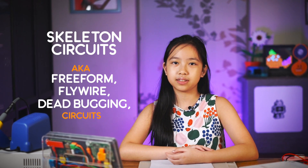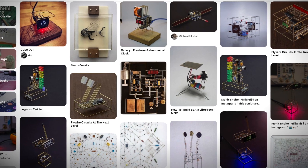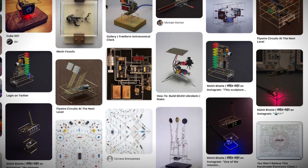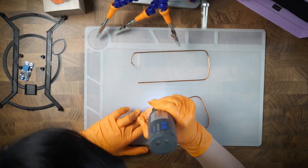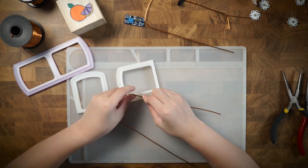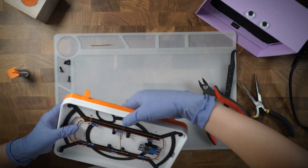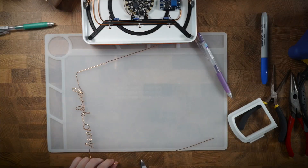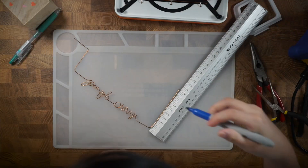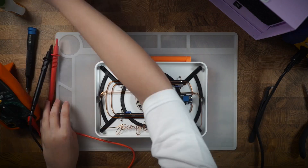It's around this time that I learned about skeleton circuits. These types of circuits don't use PCBs or regular wires — instead, they use enameled wire to build up the whole circuit. I thought this project would be a good chance to try out this technique. With the parts printed, I used enamel copper wire to build out my circuit. In some places I used a 3D printed jig to help me bend the wires straight. After a bit of work I had most of the components wired and in place. For one last bit of flair, I signed my work by twisting 'Purple LNG' out of the wire to use as a signal wire for the neopixels — it won't be seen on the outside, just my little secret mark.